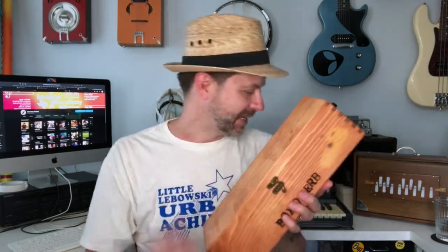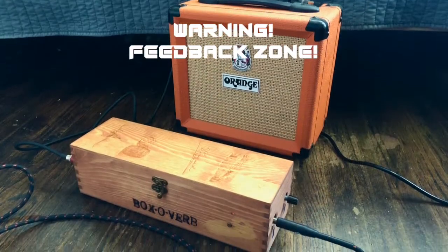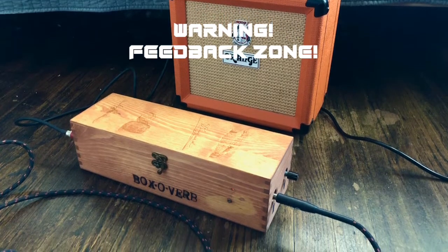Okay, so one other thing that I forgot to mention in the last video is that it would feed back really easily if you're using an amp, if you had it near the amp. So if you remember last time I had the amp down on the floor, I had the spring reverb up over here to keep them separated. If I put it near the amp, you would get feedback very easily because the audio coming out of the amp tries to go back into that spring, right? And you can get a very easy feedback loop.